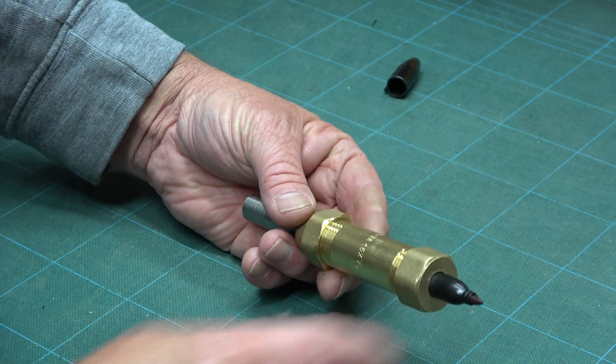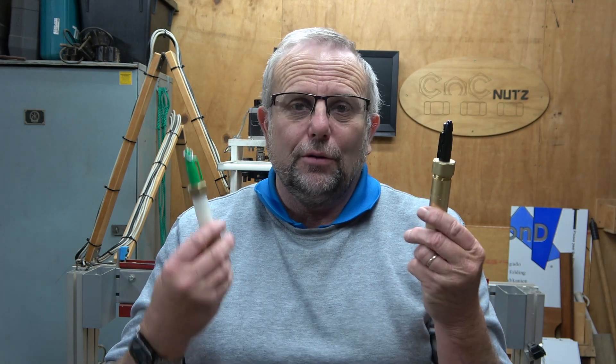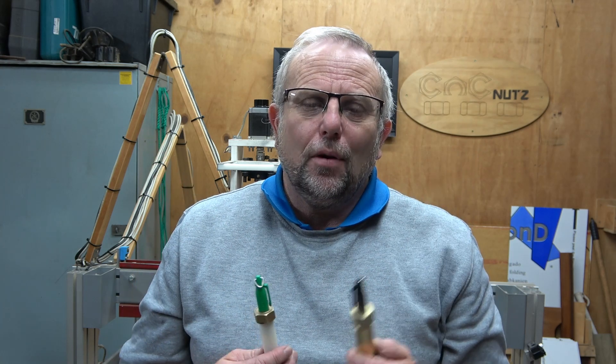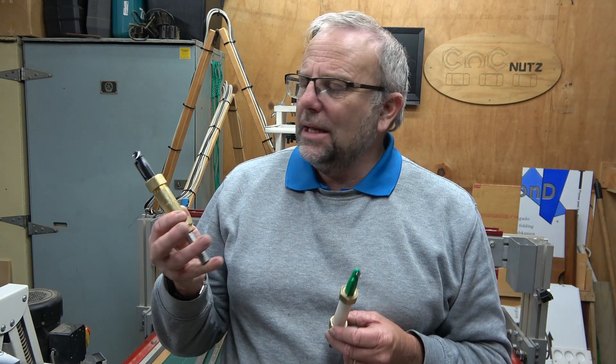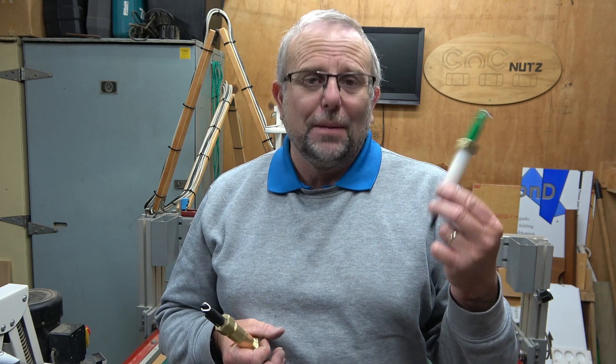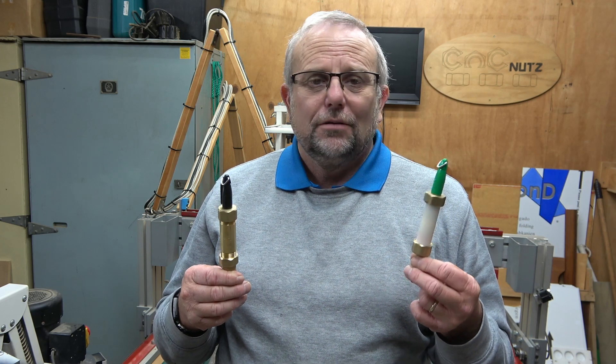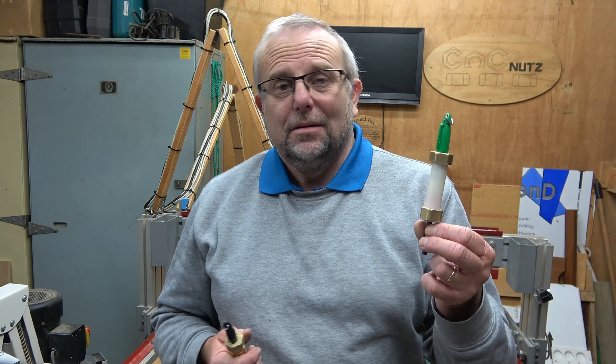So as you can see there, there was still a bit of wobble when I used this here — in fact it was around about the same amount of wobble as I had on this one. Basically the problem isn't the holder, it's the pen itself, and depending on which pen I put in here, the wobble gets either bigger or smaller. Basically, Sharpies are not precision made writing instruments — they're not designed to go into pen holders and be dragged around a CNC machine. And it makes me feel so much better knowing that I spent three times as much money and about two and a half hours of machining time to make this one compared to about ten dollars and a half an hour to make the simpler one from beginning to end, and they work exactly the same. So don't waste your time making something complex like this — spend half an hour and make something like this.